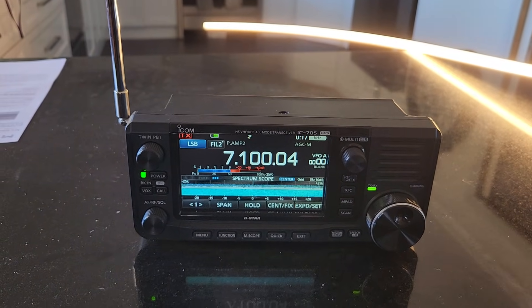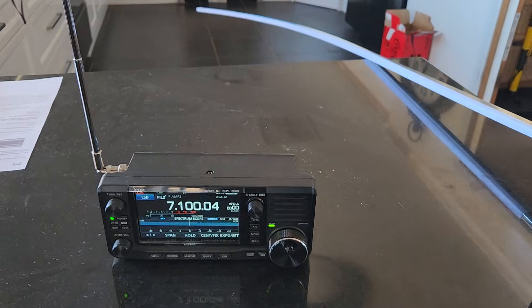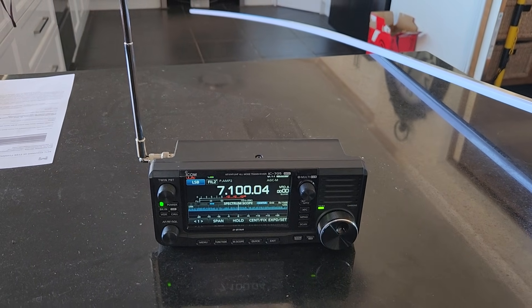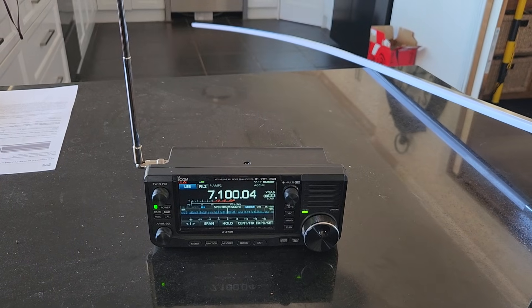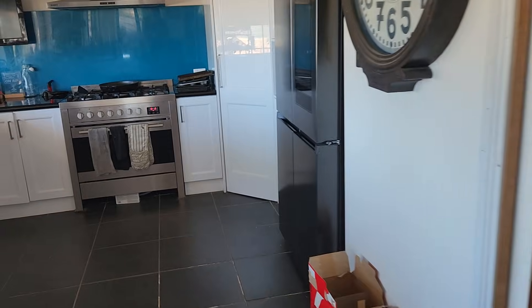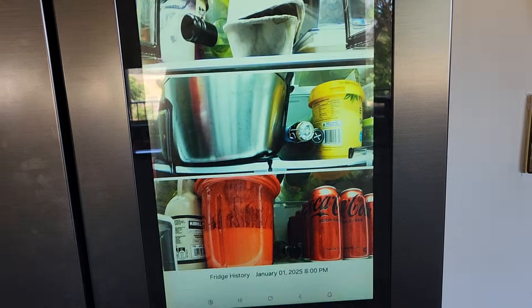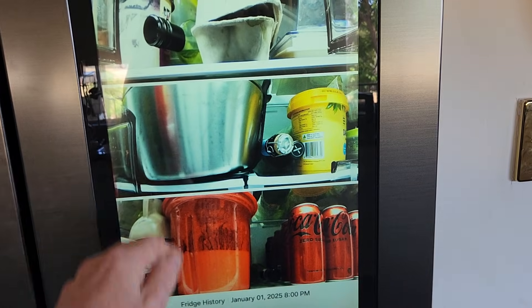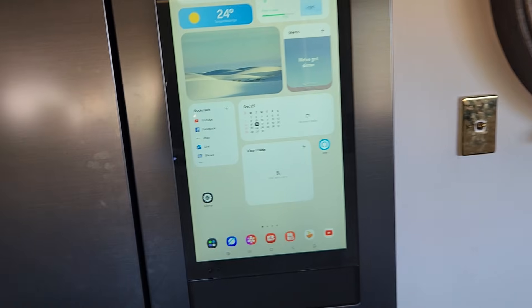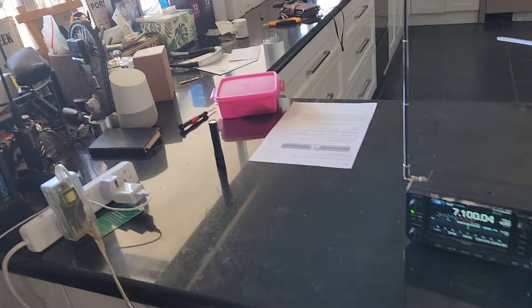So that's a little trick — the first thing we did was turn the power off to the entire house. The noise went away, which told us it's not the transformer box. Once you've got the power off to the entire house, things on my mind were the new compressors on the fridges, new screens and bits and pieces — they can be noisy. When you get a noisy fridge you're in big trouble because you've got to go through a lot of pain to get rid of it.